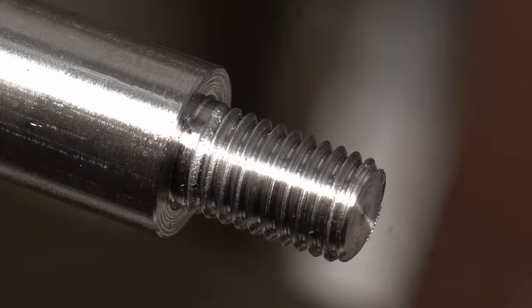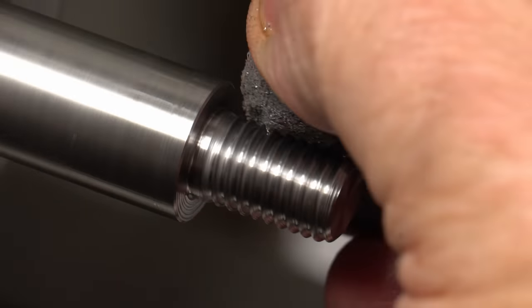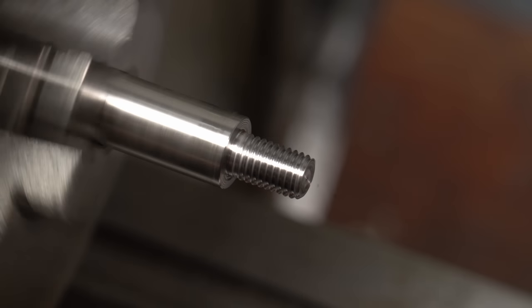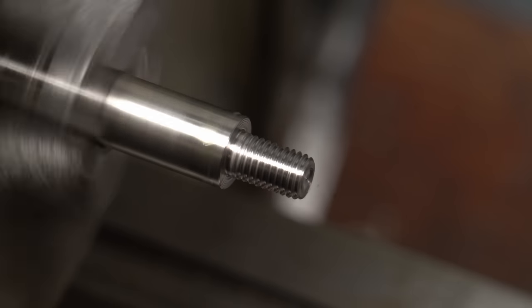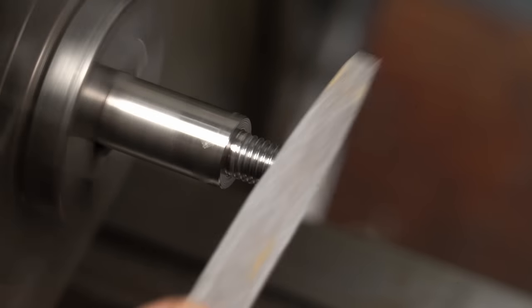With the lathe in reverse, I gave the threads a quick clean up with a wire brush and then a polish with rather crumbly Gariflex, because I've run out of Bright Boy and Cratex, dammit. The threads were cut to size by the full form die, but I like to dress the threads lightly to ensure there aren't any burrs that the brush and abrasive has missed.